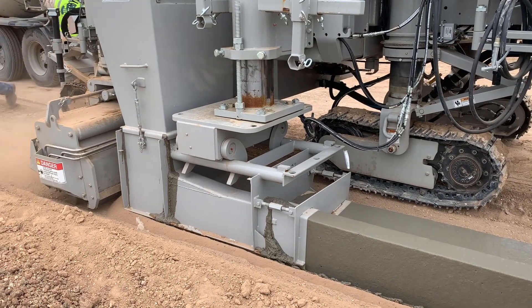We want to be careful — with narrower molds you can go ahead and set the draft and you won't have any detrimental effects. With wider molds, like a sidewalk mold, you want to be cautious because you could actually start ramping if you create too much draft.